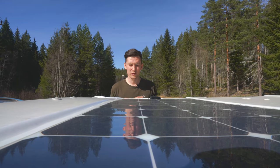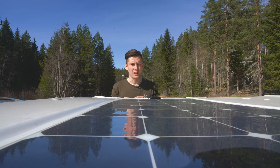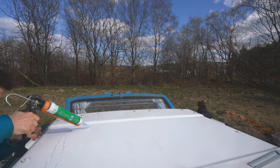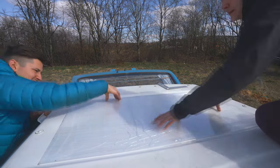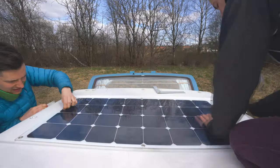Quickly about the panel — this is a 100-watt flexible solar panel which is really low weight, just a few kilos. As you can see, we were able to mount it in one of the dips in our roof; it's really flush and doesn't build up any height. The way we mounted it was super easy — we bought a small plastic plate to keep underneath to prevent the panel from soaking up water, cut that board, glued it onto the panel, and then stuck it onto the roof.